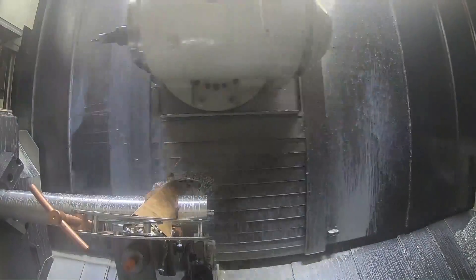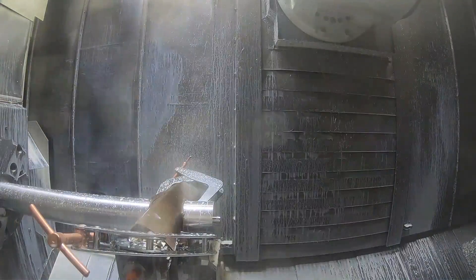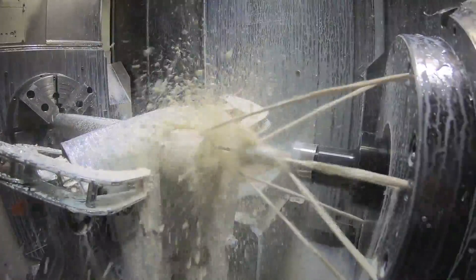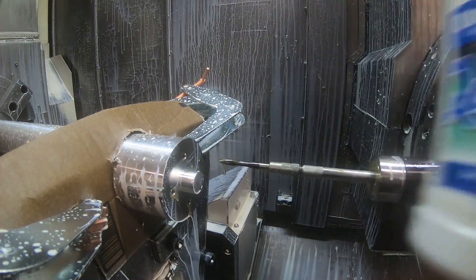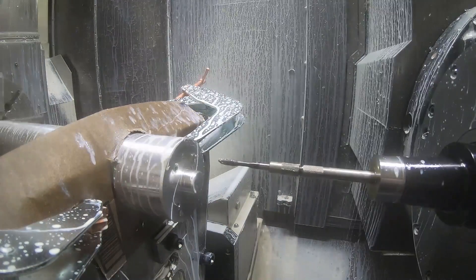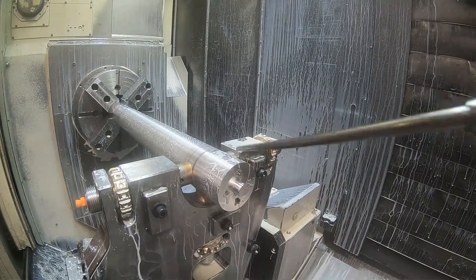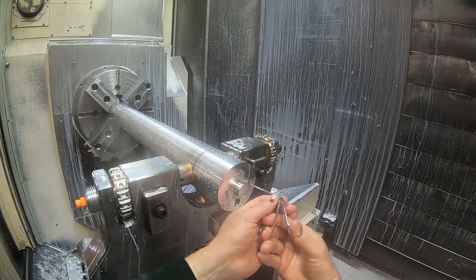That's the rough face mill just to knock off the major stock. Then with a 1.5-inch end mill - there's going to be a pilot boss on the end cap piece that fits into a pilot hole on there. I'm going to drill and tap four quarter-20 holes to hold that piece on. I don't think I took any video of modifying those end cap pieces, but I had to enlarge that hole for the boss, drill four holes for the quarter-inch screws, and on the other end open up the bore for the 5/8-12 thread. Cleaning out the shavings from the tapped holes.